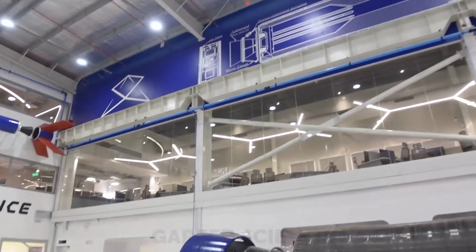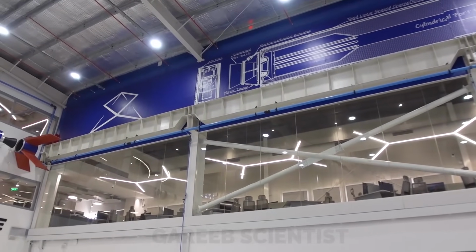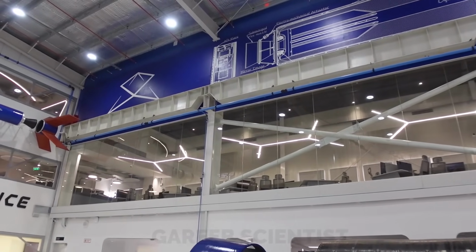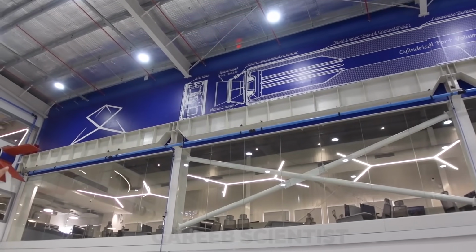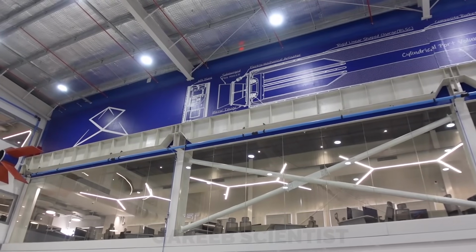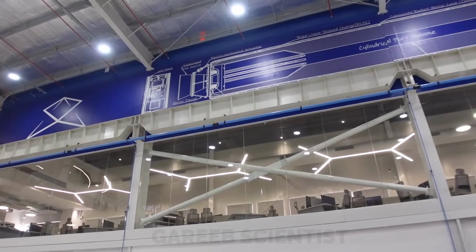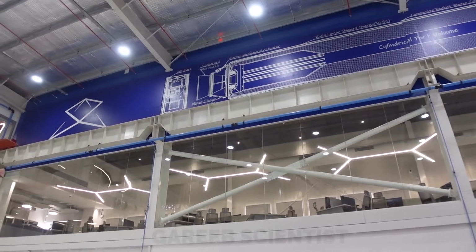Yeah, sure. So, the submerged flex seal, I don't know if you have it here. Yeah, that is submerged, no? You can see the nozzle projecting inside the rocket. So that's the submerged nozzle. Submerged nozzle means it's submerged inside the case. You can see the nozzle top portion is inside the motor. So that's what makes it submerged.